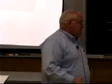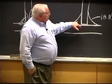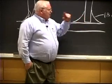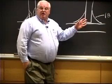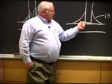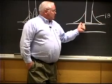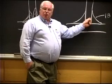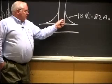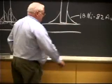Until about 1982, they basically used 18 nickel, 82 gold as the braze alloy, which, if I remember, brazes at around 1,000 degrees centigrade, which is about the right temperature range. Actually, 800 or 900 degrees centigrade is the operating temperature range. It doesn't oxidize. Gold doesn't oxidize. Nickel's fairly oxidation resistant, but it doesn't erode. It doesn't alloy significantly with the base material, and there's almost no erosion. And so you don't end up eroding this only 5 thousandths thick foil here.